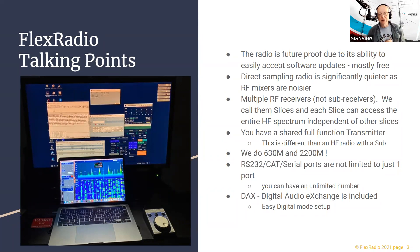Today we're getting to the point where it's part of the business model to build a radio platform that can continually be updated. The FlexRadio 6300, which came out in 2013, is still a very current radio. In our FlexRadio world we have slices instead of receivers — it's just a term for the same thing. We have full-function transmitters shared among slices. We can even do 2200 meters, 630 meters, or eight meters — you just need to build or buy your own amplifier.